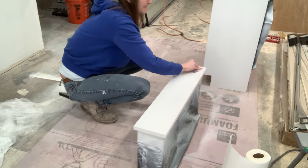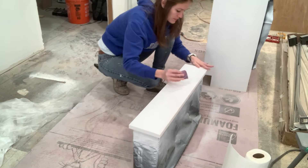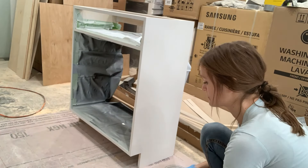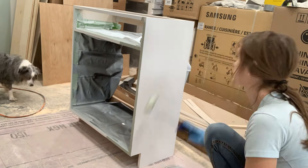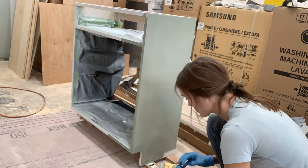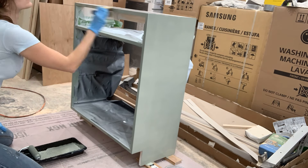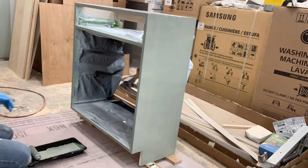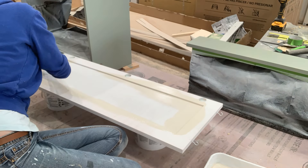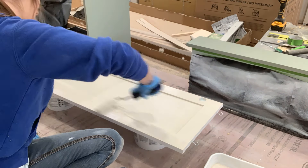I truly believe the most important thing to getting a nice paint finish on a cabinet or piece of furniture is sanding in between your coats. I did my primer, then sanded with 220-grit sandpaper and wiped away all the debris — because if you paint over that you're going to have texture. I do another coat and sand between every single coat up until my final layer. I experimented here, spraying some sections and rolling with a high-density foam roller on others. A sprayer does leave a more uniform finish, but I was really happy with the finish from the foam roller because of the sanding and proper prep between steps. So don't skip sanding between your paint layers.